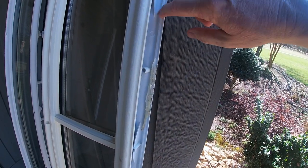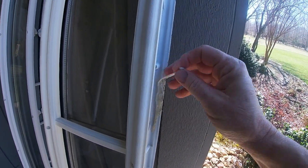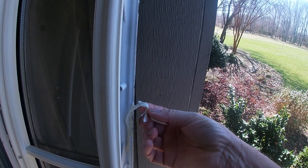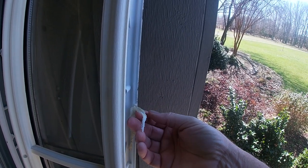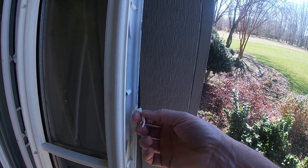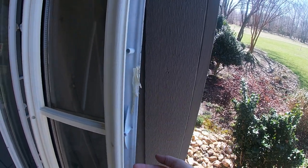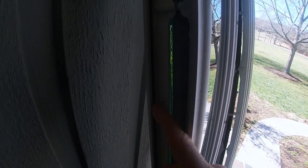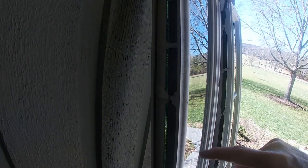While I'm in the middle of it, I've got the old unit and the new unit setting side by side. I wanted to show you the differences in the way they used to put it on back in the nineties versus the new way they do it now. You can see that it had this wide bead and they used this rubbery silicone. Now this obviously sealed it from the weather, but where we live, it gets up to a hundred to 102 degrees sometimes in August. Between the heat and the sunshine on this, I have seen this just turn into liquid and run down the door. So I don't like that. This is the old way, and the new way they have replaced it with an O-ring type seal. So that's what seals it now — the technology changes from before and now makes the install very quick and easy.